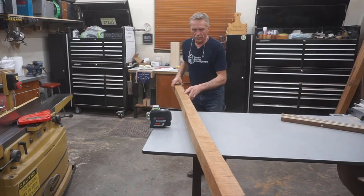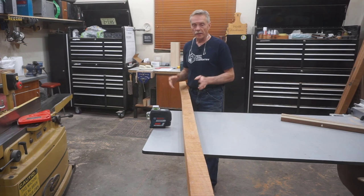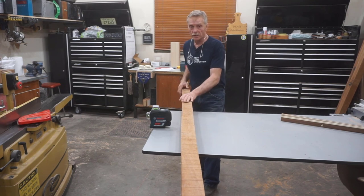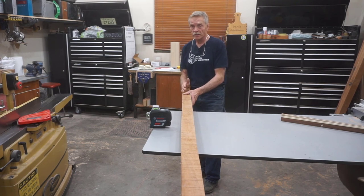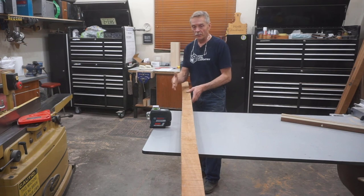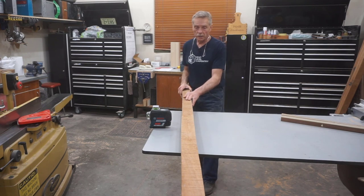There's an infinite number of questions that need to be asked and answered for straightening any piece of lumber. The worse they are, the more questions there are, and the more decisions need to be made for getting the piece straight. The good news is, once there's one straight flat face, the other five faces, long ones and short ones, can all be indexed off that first flat face. That's why the jointing step is so important at this stage.